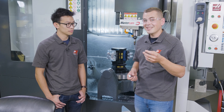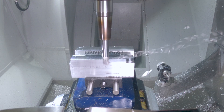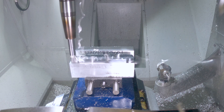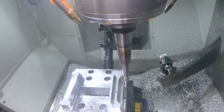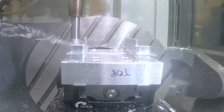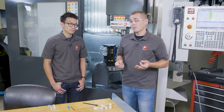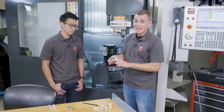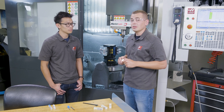For this project, we're utilizing a 3/8 and 1/2-inch tool. These heads have a corner rad and three flutes and are specifically engineered for aluminum alloys. The tool's polished rake face and sharp cutting edge allow for high-efficiency machining, even though we're running dry for video purposes here. We also had some unfavorable projection lengths needed to cut these internal fillets on the part, and the tool did a great job eliminating the chatter that Adam was seeing over on the VF2.